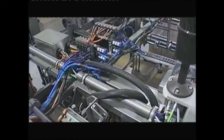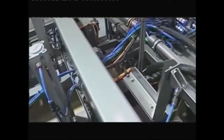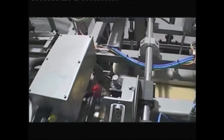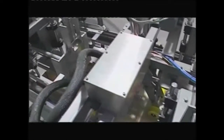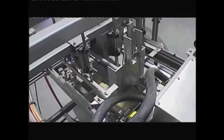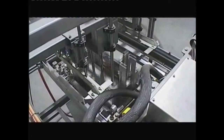The Fibre King Erector Laminator features an automatic size change for variations in blank height. Using a servo-controlled size change system, the machine automatically detects the size of a blank and then adjusts all settings accordingly. This allows a single stack on the trolley or in-feed conveyor to contain mixed sizes and runs as short as 20 blanks of one size without impacting on the throughput of the machine.